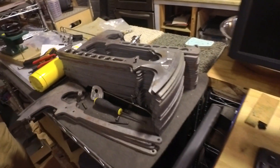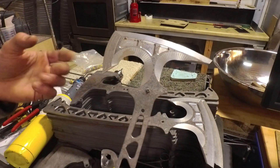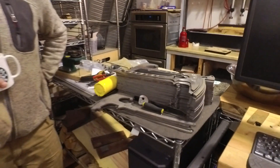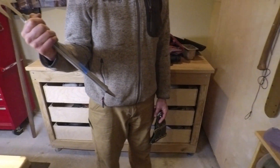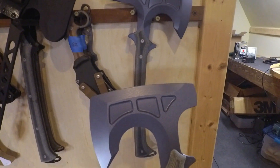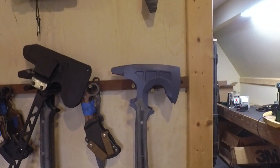All these are machined and sold to customers that are waiting for them - pre-ordered but not paid for. This is pretty close to what it's going to look like - there'll be some grinding done so it's smoother, and then it'll get heat treated, sharpened, and coated with a corrosion-proof coating. People can get those from the website self-reliance-essentials.com or omnivore-blade-works.com. The pockets are machined on a CNC mill now - the pockets are stronger than the holes.